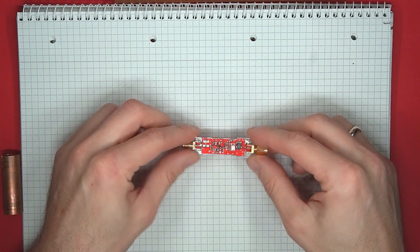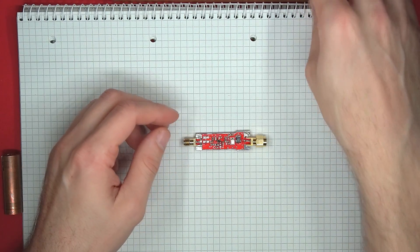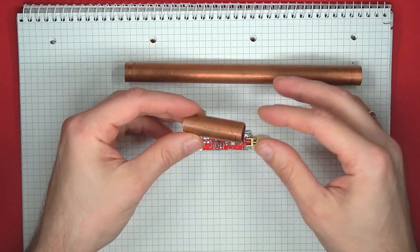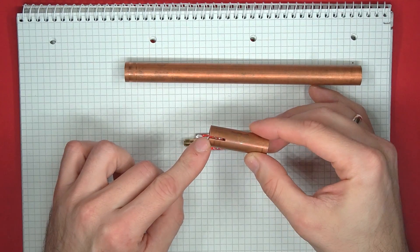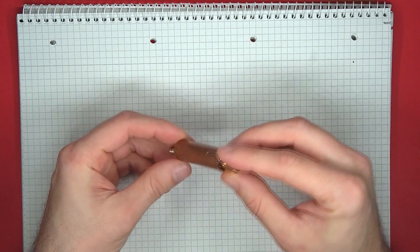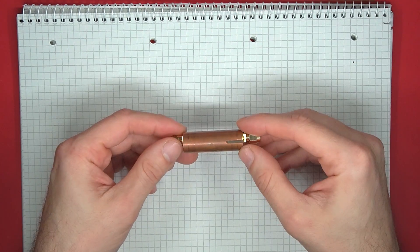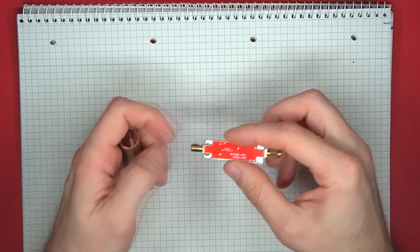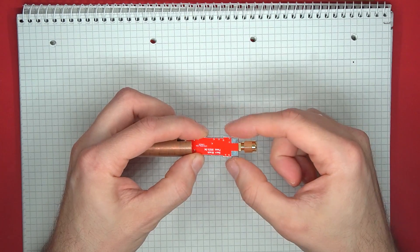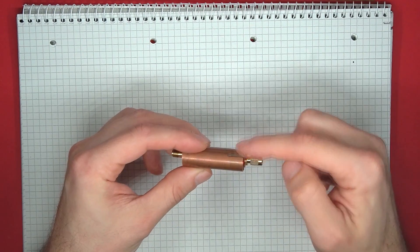The main idea behind the board shape was that I also wanted to be able to shield the circuit without investing too much into a special shielding case. The structure I wanted to use was a bit of copper piping commonly used for plumbing. I cut a small piece of pipe and made some notches into it, so the board slips nicely into this. Even though this is not a perfect solution — there are some holes on the side — it makes for a pretty nice construction, especially on a budget. The board's smaller width should be less than the inner diameter, and the wider width should equal the outer diameter, so it all looks neat when inserted.